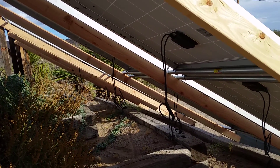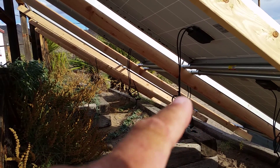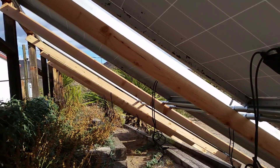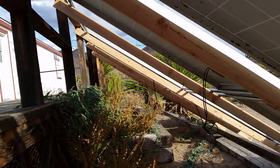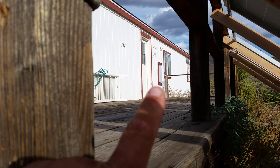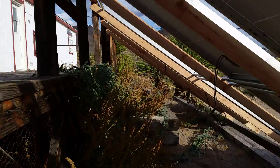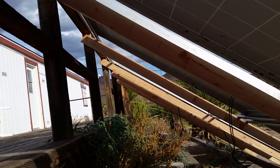All these cables you see hanging down get a micro-inverter, and this whole system will pump out 240 volts AC. It'll get tied to that little breaker box right there — or as a professional, let's call it a sub panel — and we will have solar.